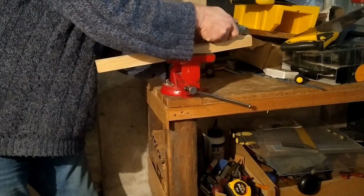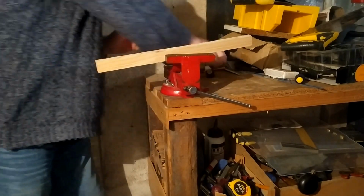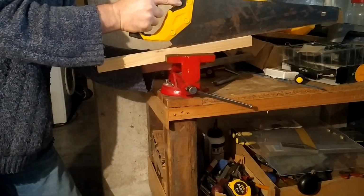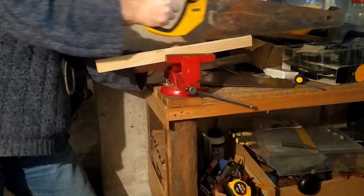And then all I did was progressively widen that mark bit by bit. The very first thing I used was a box cutter, I believe as it's called in the US, or a Stanley knife as we call it in Ireland or the UK, just to mark that line a little better. And then I used a thin saw, working out progressively to a large rip saw in order to get the trench I was cutting deep enough to accept this molding that I was going to put in. And then I just put the molding in with a little bit of cloth over it and a wooden mallet in order to knock it in, and it stayed in place lovely. And that worked out actually fantastically. So that's how I put my molding into my arcade cabinet, and I think it gives it a nice little finish.